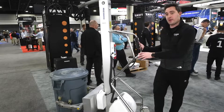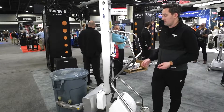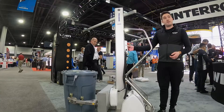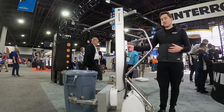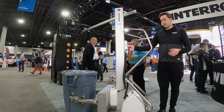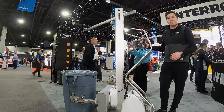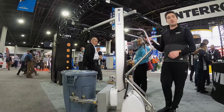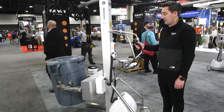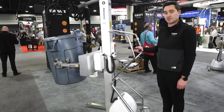In the middle here we have our control panel that basically operates the electronics on the lift. When I'm ready to grab a barrel, I'm just going to hit the button that collapses the arms and squeezes in. Once we have a good enough grip, the arms will stop and we're okay to lift using our control stick up and down controls on the right here. The controls are variable speed — if I push in lightly it'll go to one speed, and if I push in further it'll go at another speed.